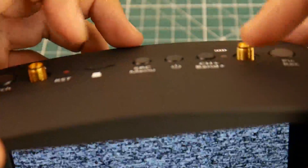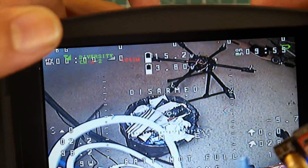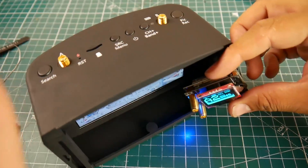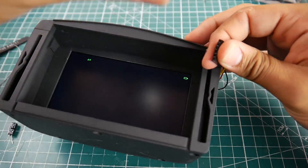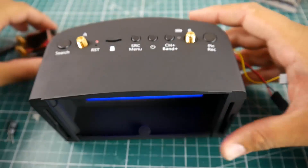Just to prove concept — we're on diversity. Let's put on the correct channel, which is A2, and hold this. A2 — now this is on diversity mode, which is really nice. Then we go back and now we're on AV mode with the Fatshark module. Just to prove it again, we'll disconnect the module and watch the feed go away. There we go — AV. Beautiful. That's it — just that simple. Three wires.